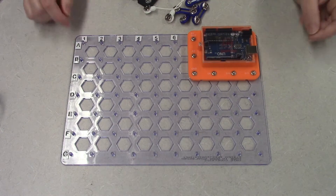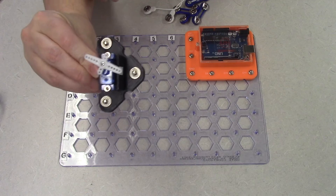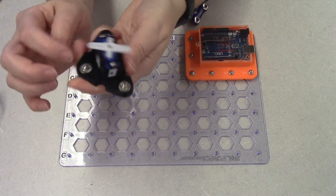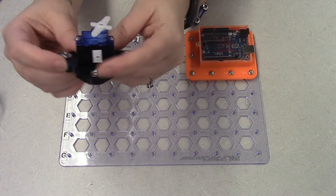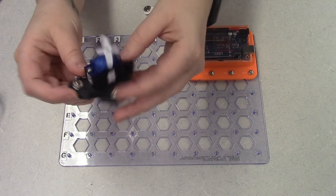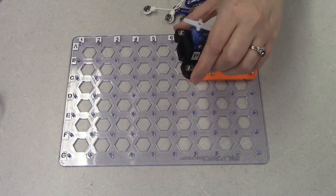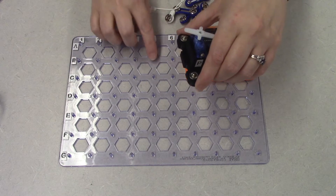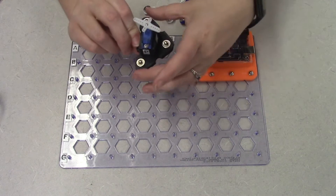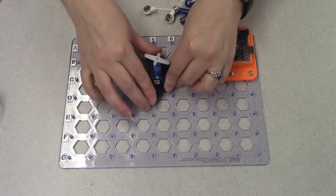We snap the snap Pino in the corner and then place down our servo module. There are three parts to this servo module: one side is the plus side where we give it power, one side is negative where we ground it, and one side is labeled P for pin where we connect it to one of the Arduino's pins to send a signal. We're going to set up our servo covering three points: B5, C6, and D5 — forming a triangle that looks like an arrow pointing towards the Arduino.